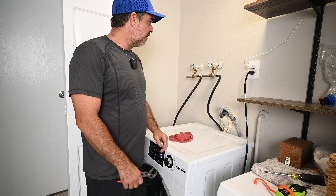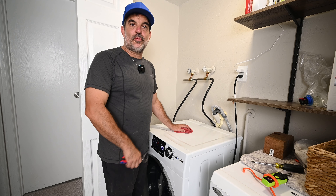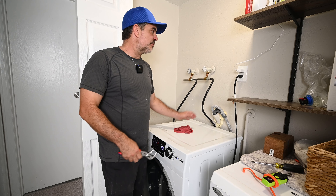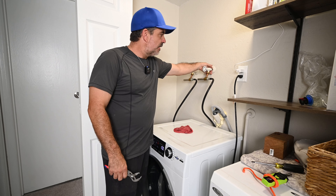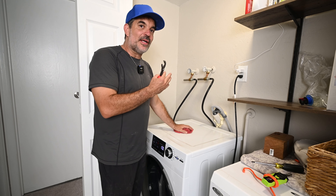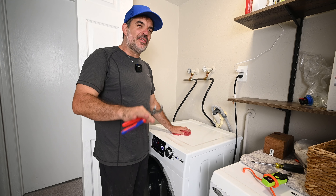The pipe did shake a little bit, but that thump sound is pretty much completely gone. That's the Sioux Chief water arresters — hopefully they last more than a year, hopefully they last for a long time. I just need to restrap this pipe and hopefully it doesn't come unstrapped again. This is definitely going to quiet down the washing operation.